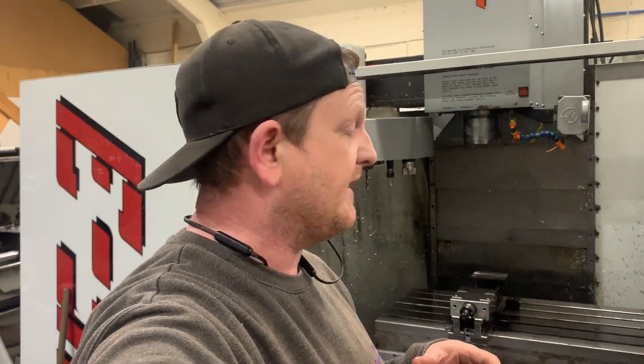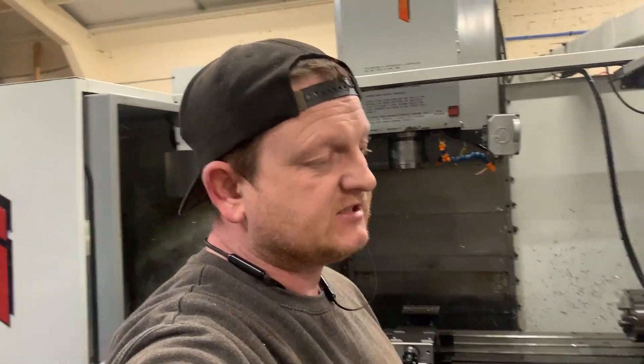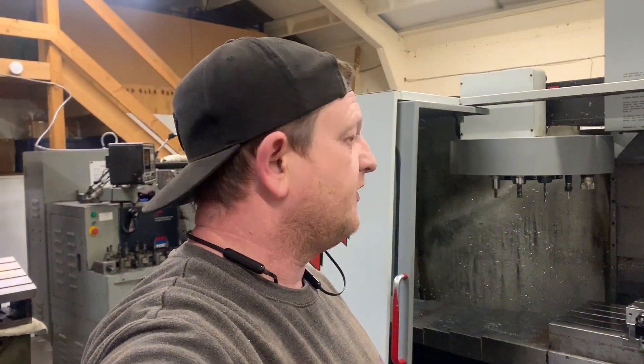If the spindles are the same, I'm going to attempt to put three-phase power directly to the motor on the Haas and run the spindle to test it. If the spindle seems okay in that one and it doesn't slop around like this one, I'll take it out of that one, drop this one out, and put it in here to get me up and running quickly. Then in my own leisure, where money allows - because everybody knows spindle rebuilds sent off are very expensive, and Haas spindle exchange is very expensive - I will open this one and look at it at a later date. There will be updates on Haas seven-and-a-half-thousand RPM belt-driven spindles and possibly rebuilds. Stay tuned. Like or subscribe if you like the content, and we'll see you again soon.